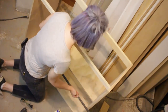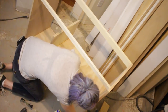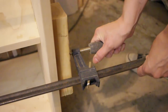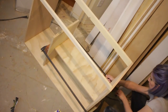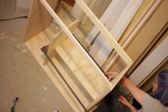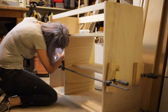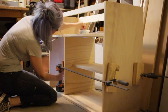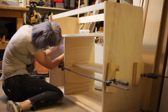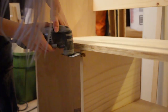Using some scrap blocks not only protected the surface of the cabinet, but also helped to distribute the pressure from the clamps, giving me even more even pressure. My design calls for a main shelf that runs horizontally across the cabinet to hold the speakers and the record player. Since it could be hidden from view, I used pocket holes on the underside of this panel to secure it to the sides of the cabinet. The next piece to attach was the horizontal face frame.